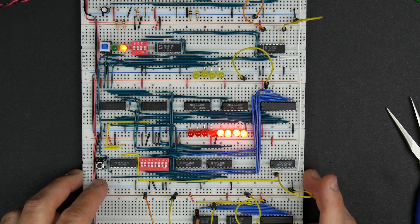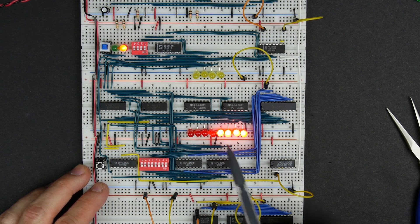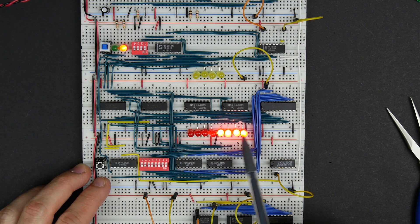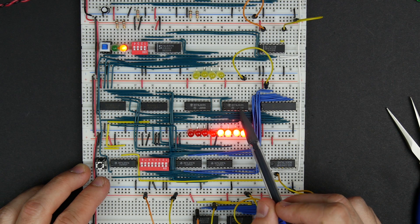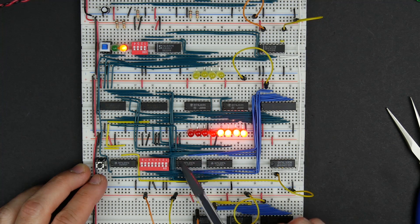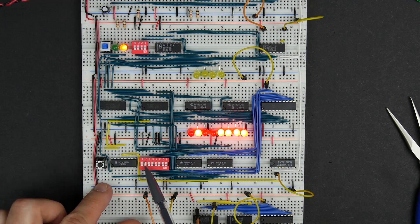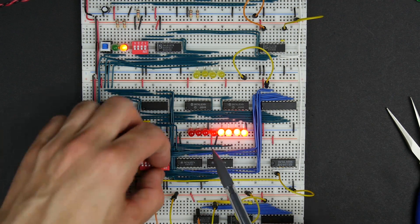We're making progress. It looks like we wrote... I think I see what's going on. So I'm looking very closely here. We wrote zeros here, we wrote ones here, and whenever you see ones, one thing to think about is that one is sort of the default input. So if something's not connected, you get a one, because all the inputs on these 7400 series chips are pulled up — they have pull-up resistors on the inputs. So that makes me think that maybe this is hooked up sort of correctly. If we set that bit, it's writing that there; if we turn that off, it's not writing it. But no matter what we set these to, I'm guessing it won't change. Yeah, nothing happens there.